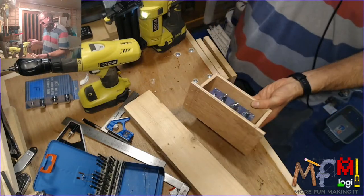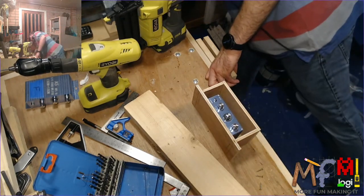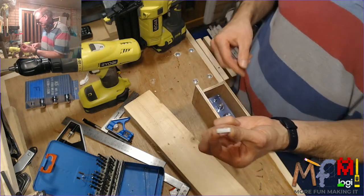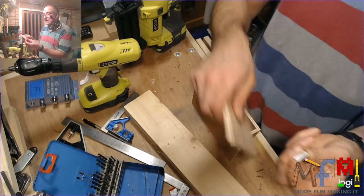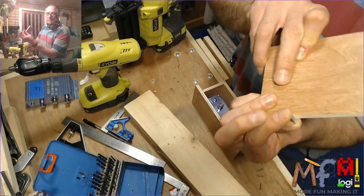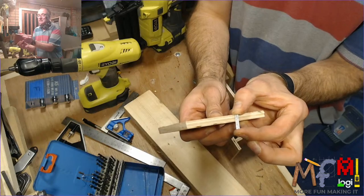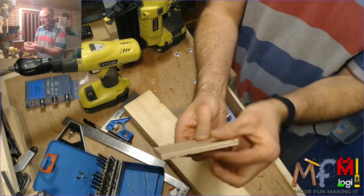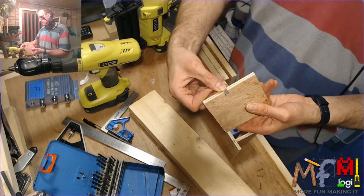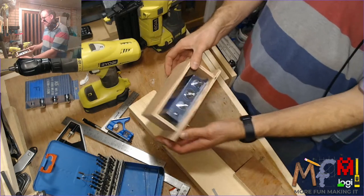Okay, I haven't got any brad nails, especially because these are right. So the length of brad nail that you're supposed to use. Oh, I've got one here. Actually, I'm sitting on top of my little storage box. These are the length that I'm using right now. And the length that you're supposed to use is around twice the thickness of the wood that you're going through. Oh, God, this is like 4D chess. This is about right, actually. It's a tiny little bit longer than double the thickness. But that's fine. What do we think?